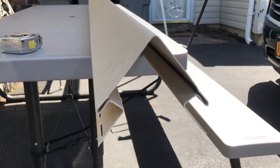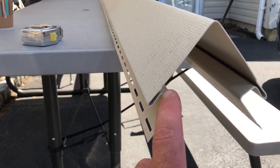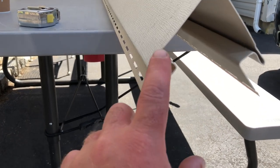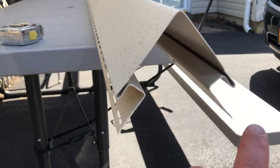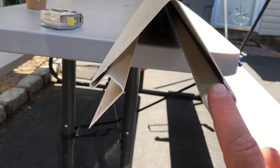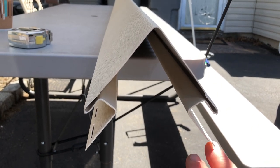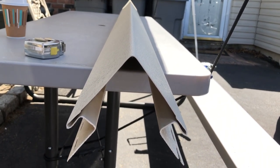This piece, as you can see where my finger is at the very edge, has a lip and a route. So I will cut the entire length going through. From this point forward, all I need is this lip, which is about a half-inch long, to grab the existing J-channel which is on both corners. I'll do that on both sides. This point where my finger is forward and down will be cut off with a sharp utility razor, so be careful.